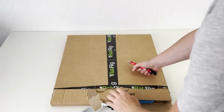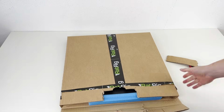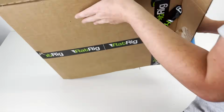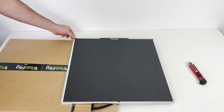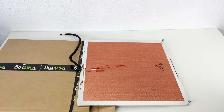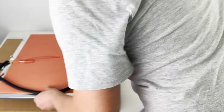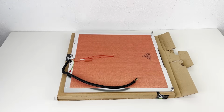Allow the massive 8mm aluminum print bed to heat up sufficiently before performing any bed meshing or starting a print. Depending on the bed size and set temperature, it might be advisable to wait an additional 10 to 20 minutes after reaching the set temperature on the sensor. I wish there would be a switch to just drill a hole at the center of the aluminum bed and to insert the temperature sensor to where it belongs, on the print bed and not on the heater.